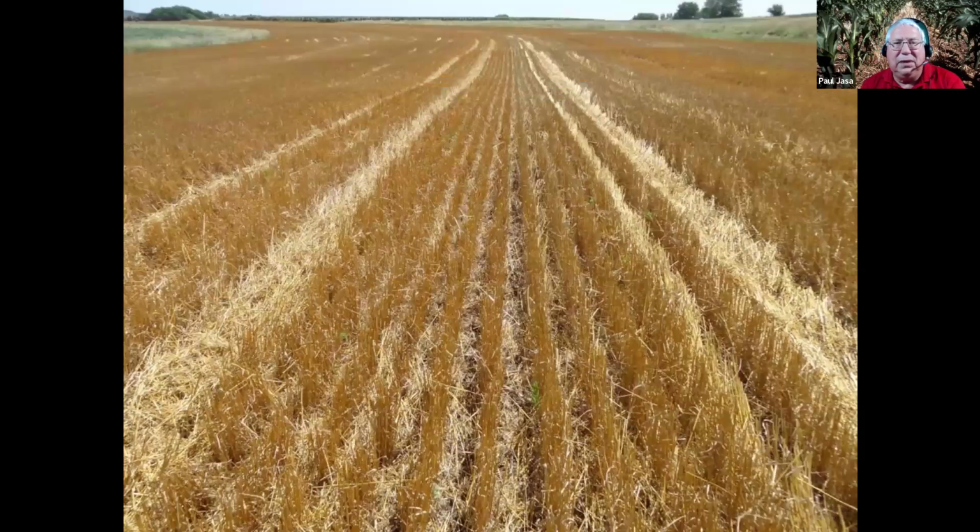Here's wheat stubble already planted to a cover crop with that Crustbuster drill. Again, the depth control is behind the opener, so it left all the wheat stubble standing. And I get a lot of farmers, especially those who are using stripper headers, say, why would I plant a cover crop? Because my air seeder knocks over all my residue. I say, you've got the wrong air seeder for doing cover crops. Again, I like the double disc opener with depth control behind. A lot of people say, well, the single disc opener works better. If it worked better, why wouldn't there be single disc openers for corn planters?